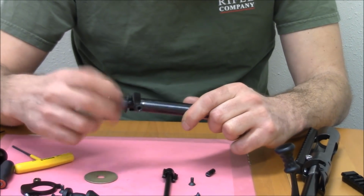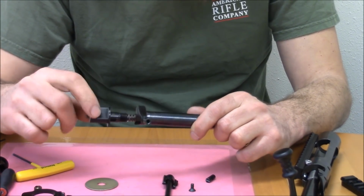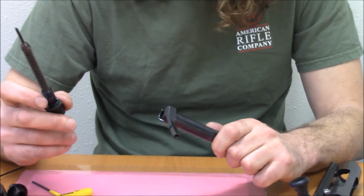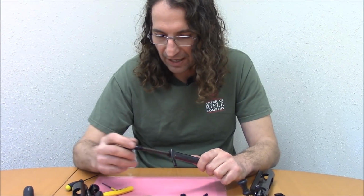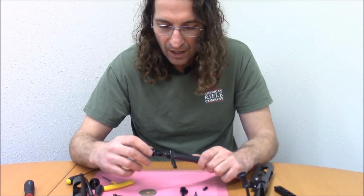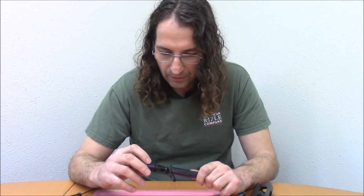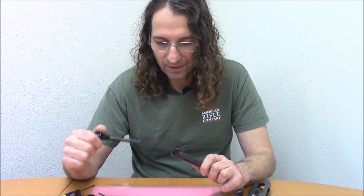Now, a lot of people are going to say, hey, why don't you use a bayonet style fitting between the bolt shroud and the bolt? And the reason for that is I'm just not comfortable with it. If you look at the original Mausers, they use buttress threads, which is a very strong thread, resists axial load in one direction extremely well. We use very good materials. All this is hardened steel, really strong stuff. But basically, in the event of really, really bad overpressure situations, I don't want to blow the striker assembly through your face. That's why I don't use bayonet style fittings.